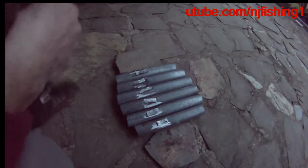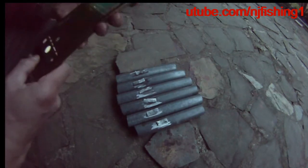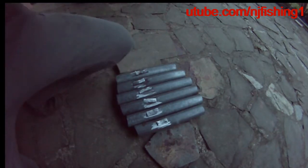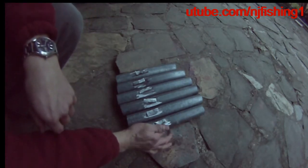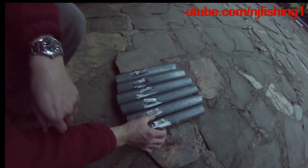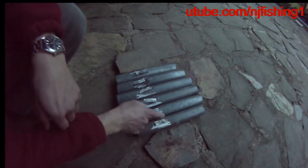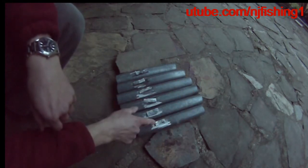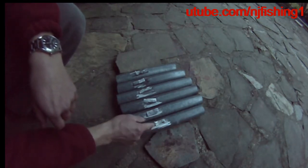I've put the six metal plates on top of the rod holders now, and I'm going to be welding them next. Basically, you just put it on top like this. Once I tack weld this piece onto this round tube, I'm going to use a hammer to hammer the edges so the metal piece will attach to the round tube more closely and the gap will be smaller.